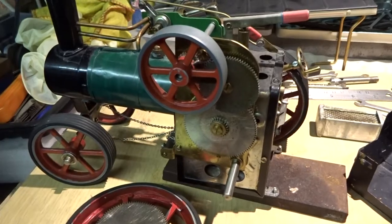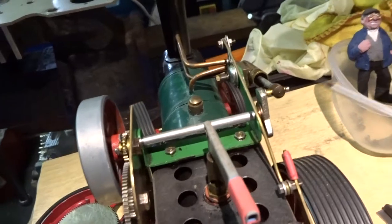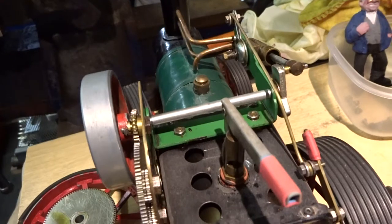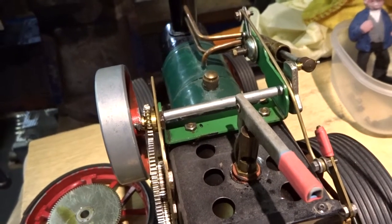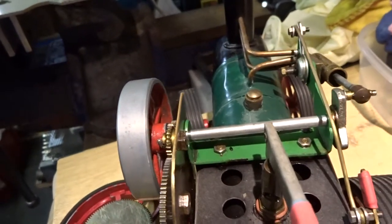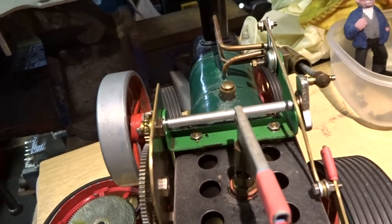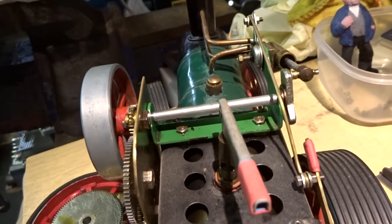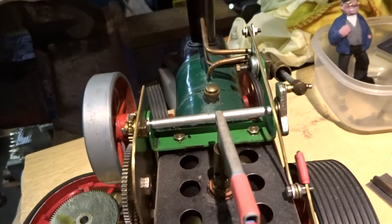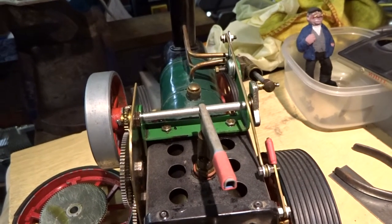I probably fitted an O-ring to the cylinder like I normally do with these when I fiddle about with them, so there's probably an O-ring in there somewhere. I also, because of wear problems, made a brass sleeve to go over the crank pin to reduce some of the wear — these things seem to wear quite dramatically at that point. So I fitted a little brass sleeve, might be bronze I don't know really, to mitigate against that.